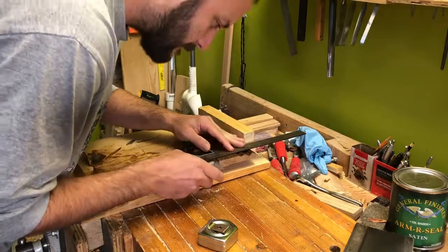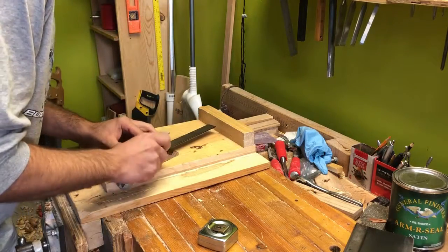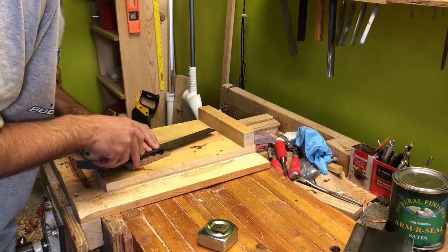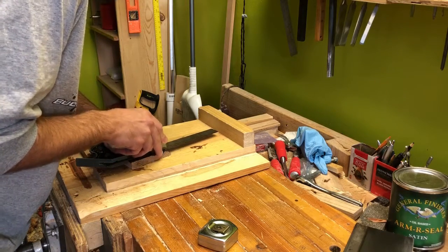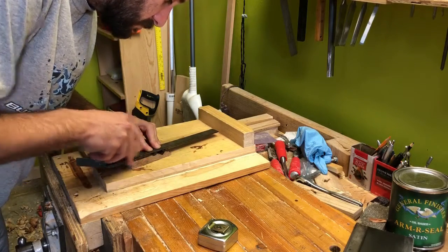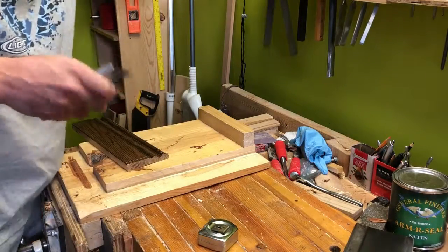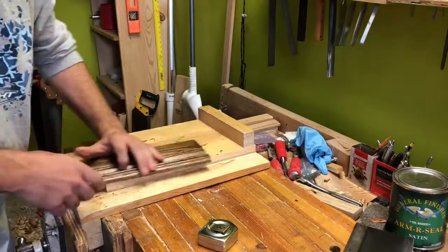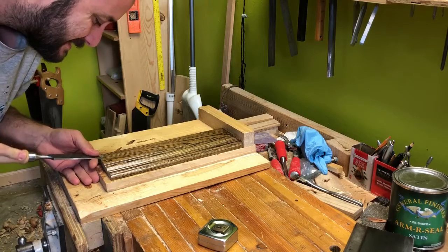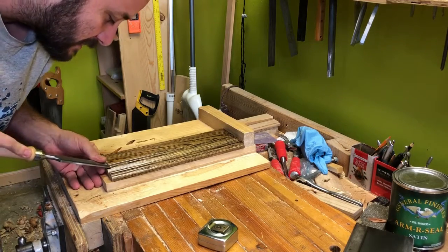All right, so you make the mark, then you find the mark. And you have a good solid back behind it. You don't really want to try to be pushing down over here. That's kind of dumb. Excusez-moi. Now, we have that there. Let's do a little knife wall, as Paul Sellers likes to call it. I love using it.